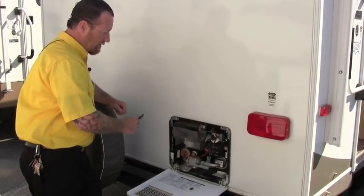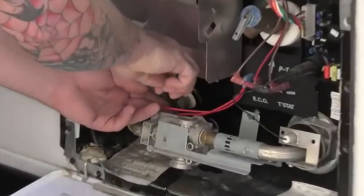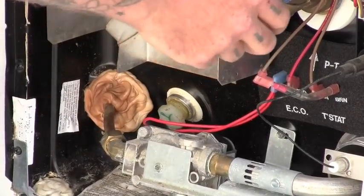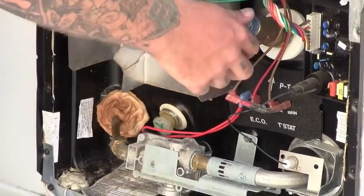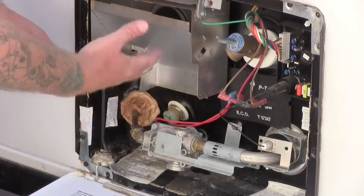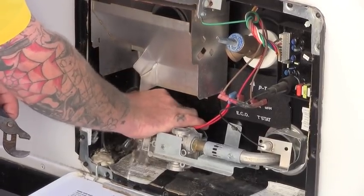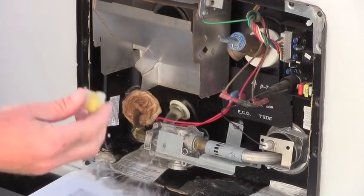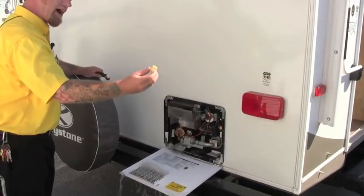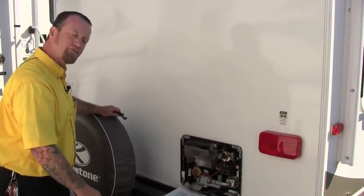Back to our water heater — I'm going to drain this off right now. We've got the plastic plug down here below, so I'm just going to loosen this up. To relieve the pressure on the hot water heater so we don't get a blast of water, I'm going to crack this relief valve, which will also help it drain out a little better by letting some air into the top of the tank. There's the plug, there's our water coming out, relief valve's open — good flow of water. When you put the plug back in, you'll want to put some Teflon tape or some Rector Seal on it to seal it up so you won't have any leaks in the spring.